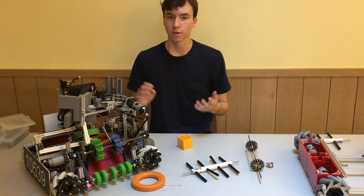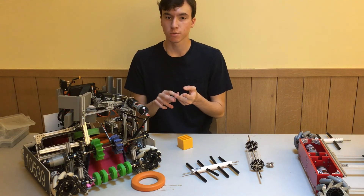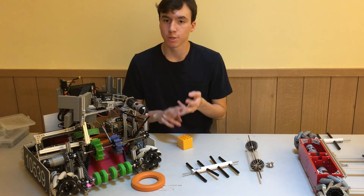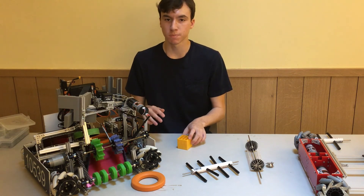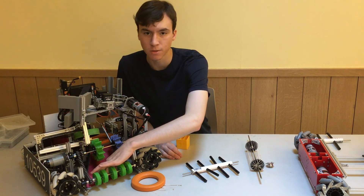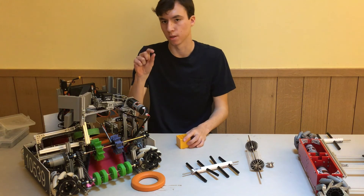Overall, for an effective intake, it should be able to deal with the game elements at any orientation, and funnel them to fit into the robot's mechanism using the ramp and intake elements. It must also ensure the objects do not get stuck by using a proper surface on which the objects can slide. The lip of the surface must be as thin as possible for sliding objects — in our case, just a thin piece of sheet metal — though for rolling objects this doesn't matter as much and can be a little larger.